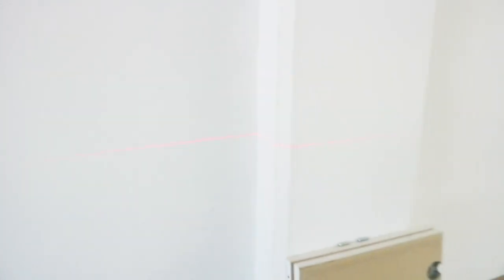You can see exactly where to stop and where to start your mortar and tiles for the installation. It's clean. I also use the laser vertically, which looks like this. When there's too much light the laser will disappear, but this is a strong straight line.